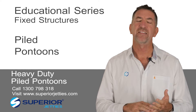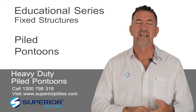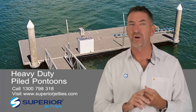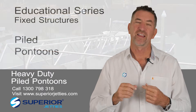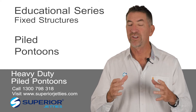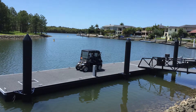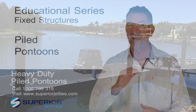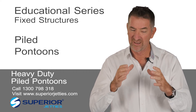Piles can be anything that will stand up and take that load. It can be an I-beam of steel, it can be a pipe — pretty much whatever people desire. Most commonly we use a spun concrete pile that is hollow in the centre with a jetting tube. They are widely used in the industry and come in sizes of 350, 400, and 450, designed with different amounts of steel for more or less strength. You can also use steel, which can be dialed up for the application, and often that has a black polyethylene sleeve over it to make corrosion in the steel inert by eliminating all oxygen from around the steel, so long as that sleeve is properly embedded.